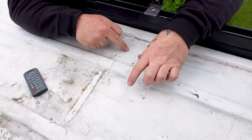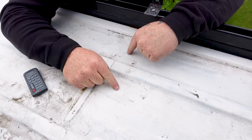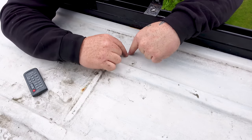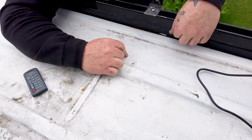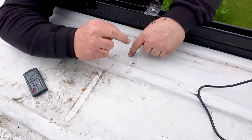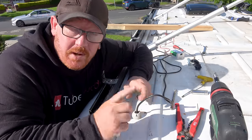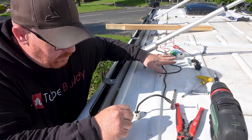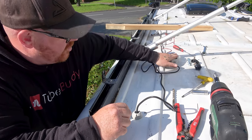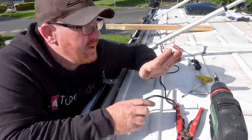Next thing I'm going to do is put a gland there and go through into the electric box and into one of the switches on the switch panel to actually make them go live. I can run the cables down here and then go into the gland. I've got the gland in there going right the way down to the back of the control panel. I've left it all up here for now and I'm going to wire the controller in the cupboard in a minute, then connect this to the actual actuator cables.